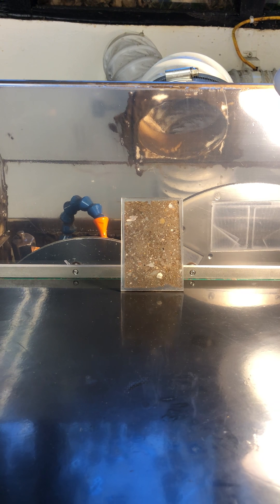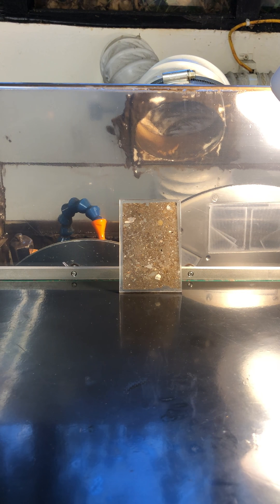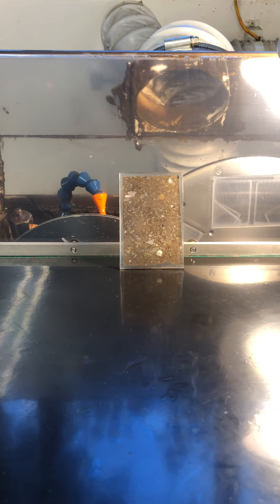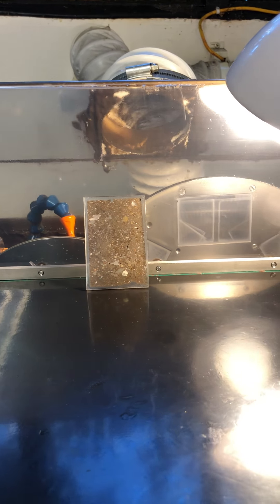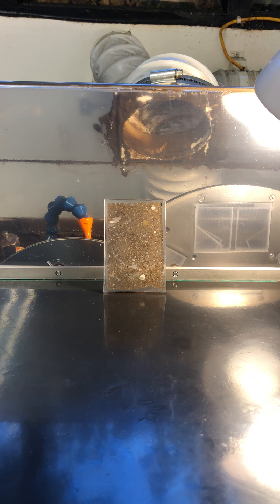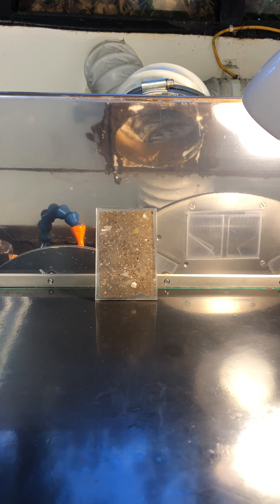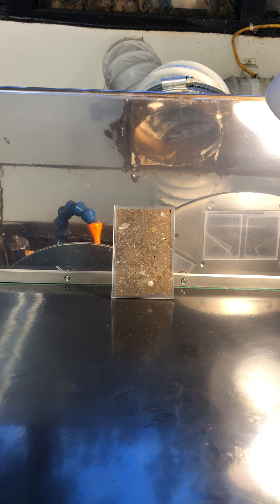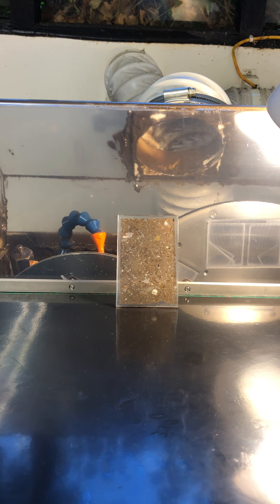Let's have a little recap here. You're looking at our finished thin section. This is as far as we could take it. I'll give you a close-up in a minute, but I just wanted to review what hopefully came through in that last video of me sitting on the stool, watching the sample plate to see when I can begin to look through to the plate through my section. Then I know it's getting pretty close to where it ought to be done. You're also looking for weak points — is a corner going, or is there a part within the section that is grinding off first? So you're looking for weaknesses.